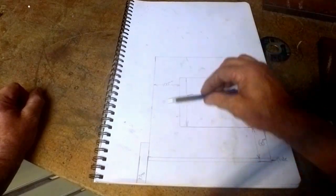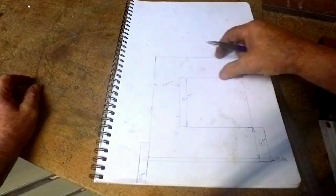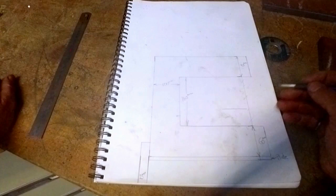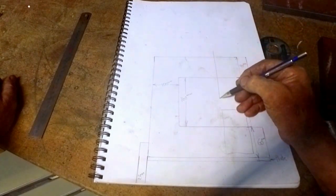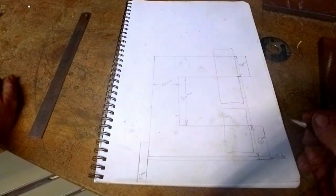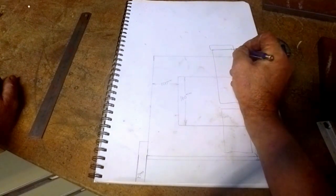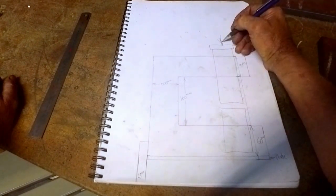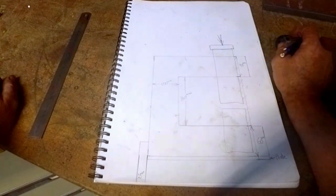It might even be a nice thick plate that will be the width of my anvil to give it a good strong sturdy platform. Then this section here is 100mm wide for strength in the C-section area so there's no flex in it. Then this section coming along the top — which is where the top die will drop down from — is also 90 millimetres. The bottom die will sit in here and the top die will come down from here and be struck from the top. I'm also thinking about putting some sort of tool steel welded material to the top that I can hit on, and when that wears out I can just cut it off and weld another one on — it's disposable so to speak.